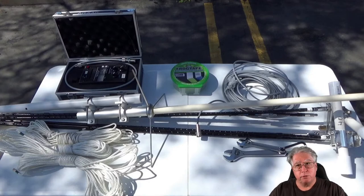I need some sort of mast. In this particular case I have this nice little MFJ tripod. Originally this was the 18-foot tripod model and I've had it for years. It has fallen over and over periods of time had stuff break on it, and I've constantly come back to repair it. As I repaired it I changed it — I wanted to make it longer or more stable. There are some modifications. This is now theoretically capable of going up to about 25 to 28 feet. The reality is the way I use this tripod, it's only good to about 20 to 22 feet — but it's a solid 20 to 22 feet, much more stable than the one I originally purchased from MFJ. However, you still need to guy it.